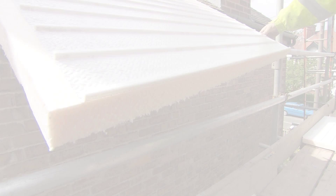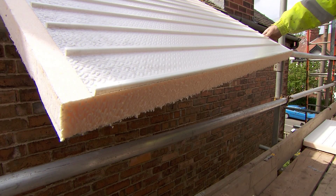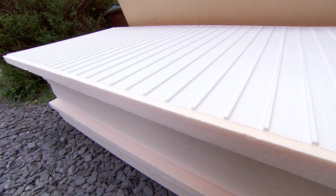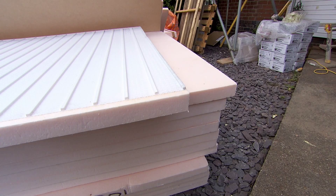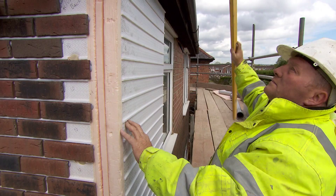The backer panel is made up of two waterproof elements: a closed cell extruded polystyrene insulation and a high-impact polystyrene skin bonded together. There is a skin overlap to identify the bottom of the panel, and this should always be placed at the bottom.